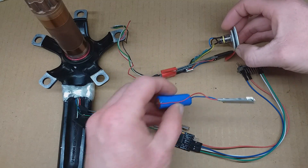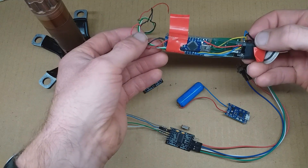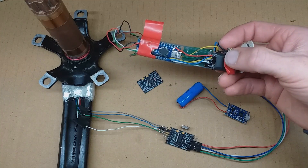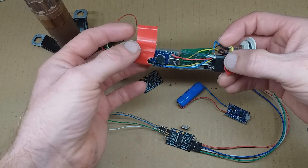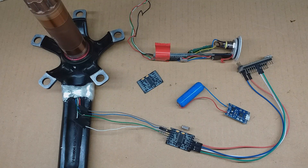There's even a space in the middle there for the button wire to come out. I need to wire up the switch again and also swap — obviously this is being fed from VIN, so that's going to be fed directly from the cell voltage instead. I'm going to feed that directly into the 5 volts. Let's get to wiring that all up.